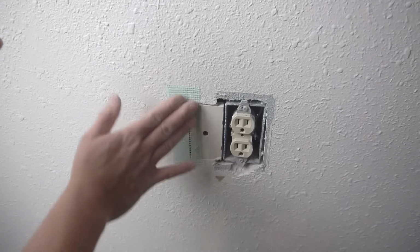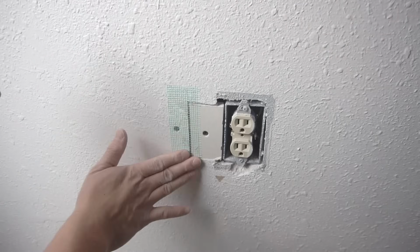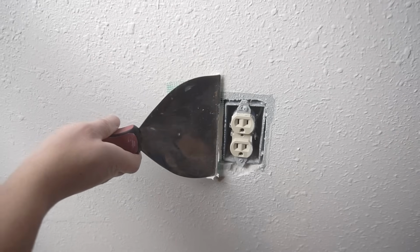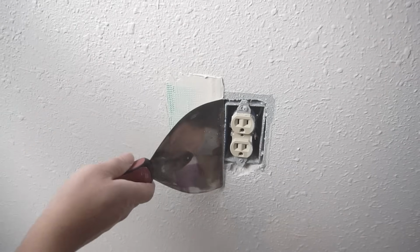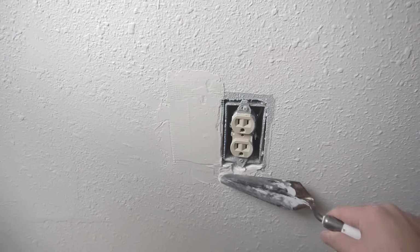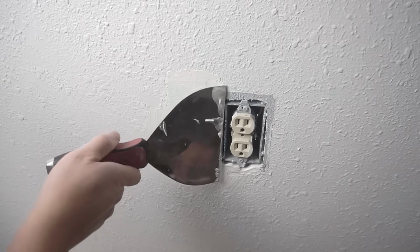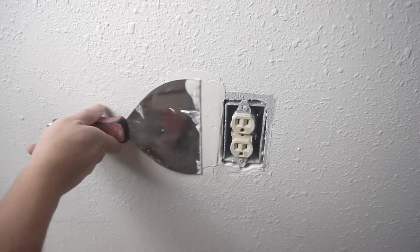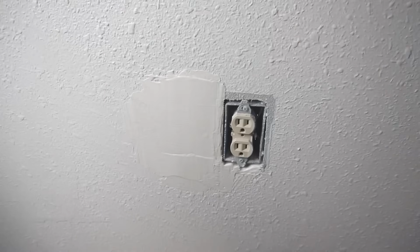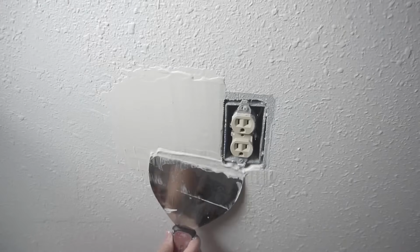Okay, so what you're going to do is just cut out pieces of mesh tape and place it right against those seams. And then once you're done doing that, make sure that you apply your joint compound. Again, you can use different types of joint compound. I highly suggest that you use the sheetrock fast setting joint compound. You have different choices of joint compound. That's quick set: it's 5 minutes, 45 minutes, 90 minutes of work time, and I'll leave all that in the description down below. It all depends on what joint compound you want to use. Again, it doesn't really matter. It all depends on how much drying time you want to wait.